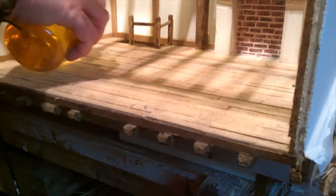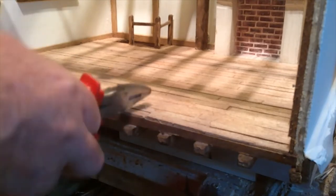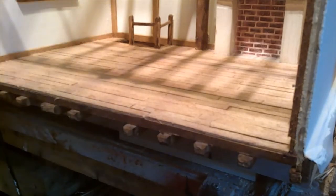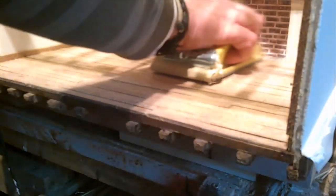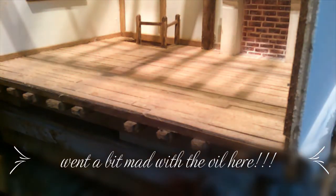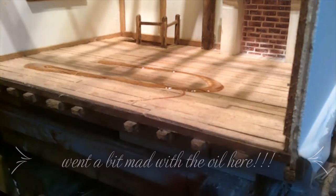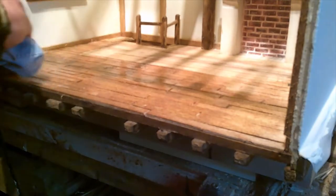Here, folks, we'll have the top floor, and again, I was nearly going to do it without sanding it down, which wouldn't have been brilliant. Move that wee secure pin. Just a light sanding is all that's necessary, and then the Danish oil. Make sure you get into everywhere. It's not just that it's bringing out the grain of the wood, but it's also bringing out the joints.